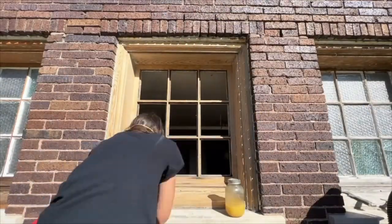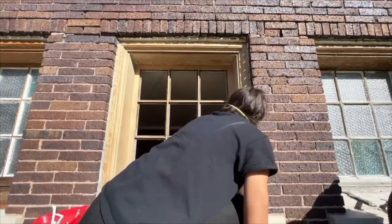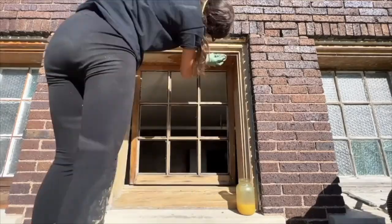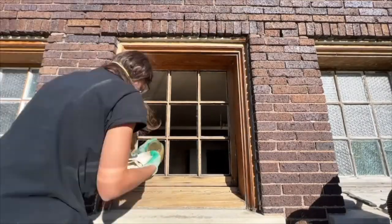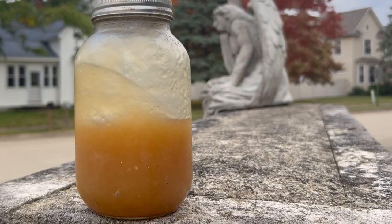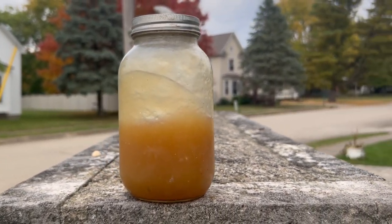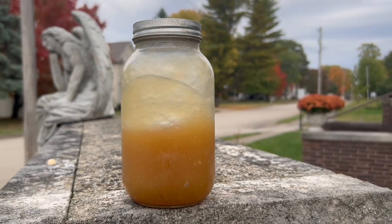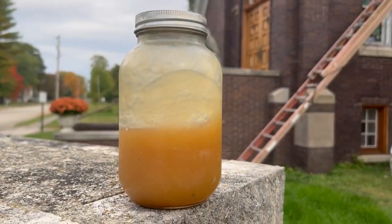The linseed mixture we are applying is a homemade mix of an old-fashioned recipe. Three ingredients: beeswax and equal parts of boiled linseed oil and turpentine. First, melt the beeswax. I used a mason jar and a pot of hot water. Then add the linseed oil and turpentine. Put the mix in a sunny window for about a day and watch it change from a dark liquid to a golden paste. I set it back in the sun to soften prior to using it.